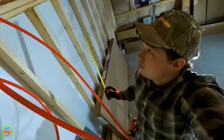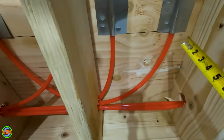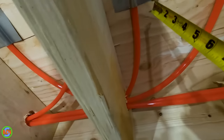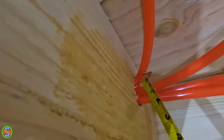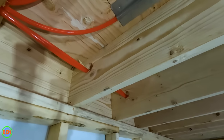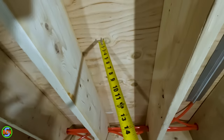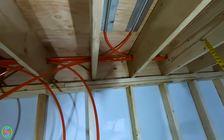In some cases you're not going to be able to avoid a tighter bend. If you have a spot where the PEX is pulled tightly up against the edge of the wood, there's a chance that over time as the PEX heats up and cools down it could move back and forth on that wood and potentially damage the PEX. So make sure any tight spots like that have some sort of a sleeve — there are lots of different options and I'll link a few in the description. Just keep in mind you don't want the PEX to be pulled tightly through framing members; it needs a little bit of wiggle room.